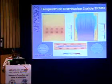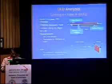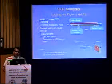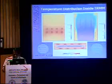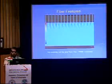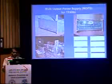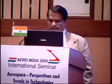While you're doing that, we have to do a lot of thermal analysis of where the hotspots are. Because the internal flow needs to be studied, we have to ensure that each and every TR module is cooled properly, because you cannot afford to cool a few of them properly and some of them least, as thereby we can have failures. The power supply is one of the very critical items, which is done in such a small size, and the cooling also is taken care of.